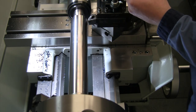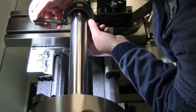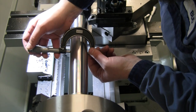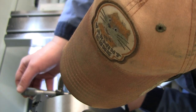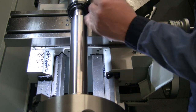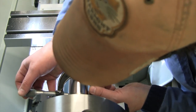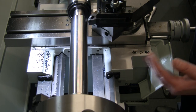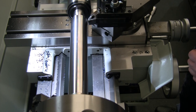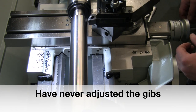I don't know that I've ever turned 11 inches long on this lathe, so I'm curious what kind of size we have on both ends. That took 101 thou — we are at 0.899 right there. We got one thou in six inches, two thou over the course of that — so I've got two thou taper over that 11-inch turn. It gets a little bit smaller as we get to the inside. Pretty much just maybe 1.9 thou over 11 inches — that is definitely going to work for our boring bar. I haven't done any adjustments on this lathe since I purchased it other than set it up for level, so that came pretty good out of the box.